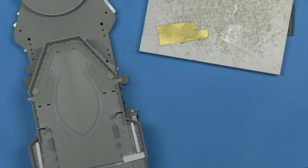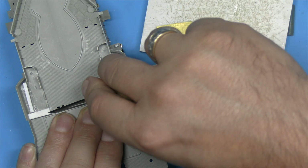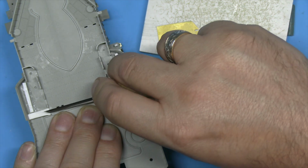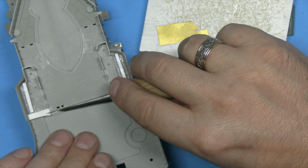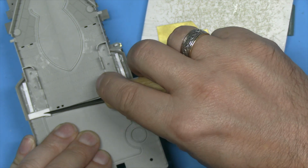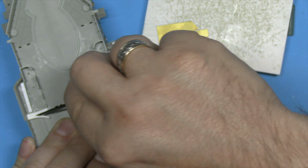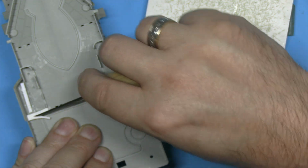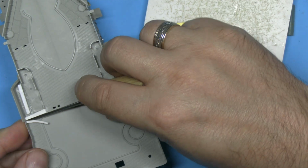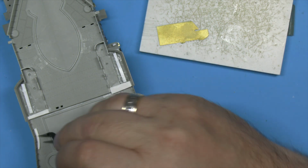Okay, larger chisel for trimming this deck back now. I'm using the flat back of the chisel against the edge of the raised lip there to keep me nice and straight, and then you can see we're just rocking it down and using the top edge of the blade to gently trim it flush. Try not to lean it back because you could put a chamfer on if you're not careful. There we go. So that looks good. Some scrap there to get rid of.